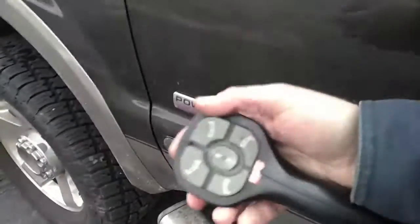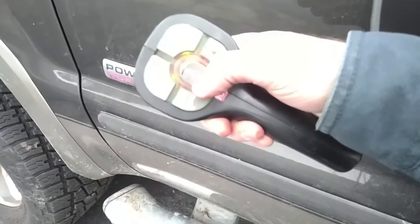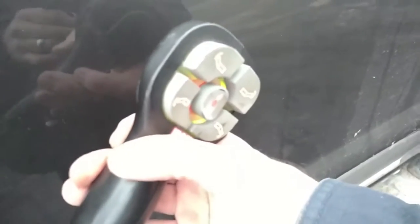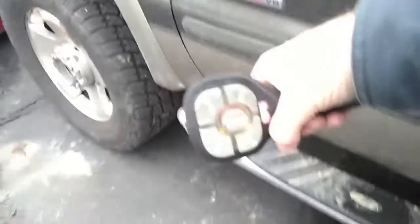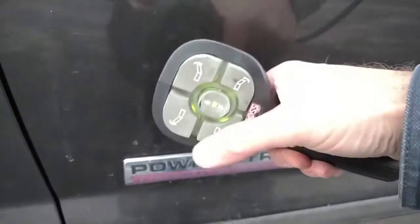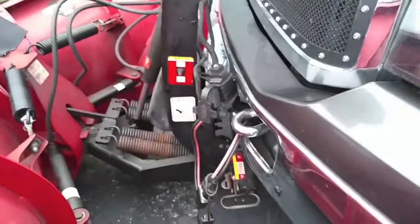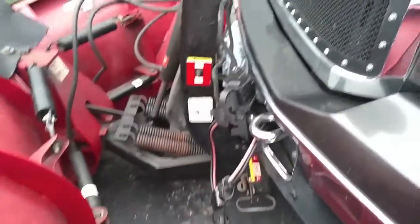You notice I have my controller off just from a safety perspective. I'm going to turn it on — you see it go green there. It's all green. And to put it in float mode — now it still won't work until I put it into float mode — push and hold the button down and you see now it went red. Snow on the ground is sort of affecting the picture here, but there we go — now you can see it. So now I'm in float mode. This toggle switch becomes active. So the first thing I'm going to do is go up. I don't want to be standing here — like the other video I showed you, I don't want to be anywhere near here. I'm going to reach in from afar and watch where I am with the plow in case something were to jerk and fall.